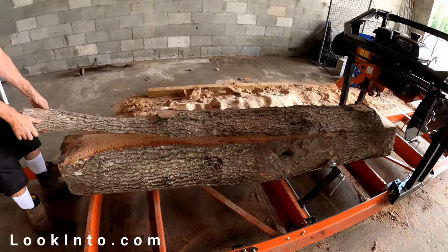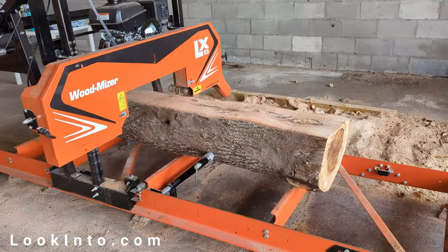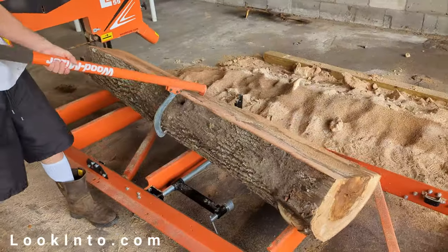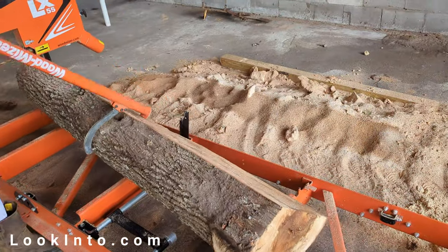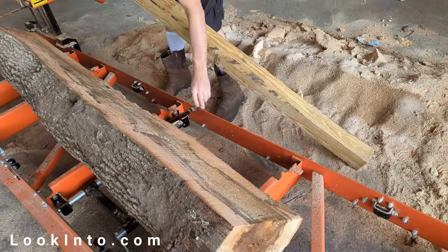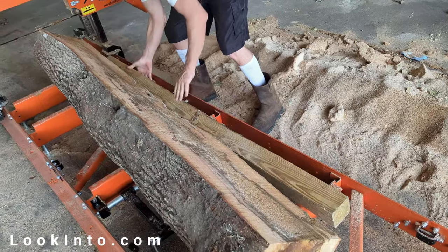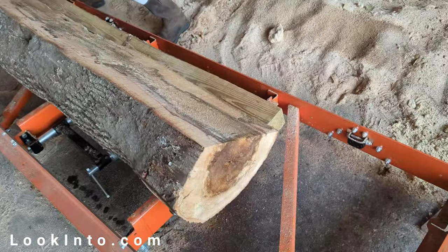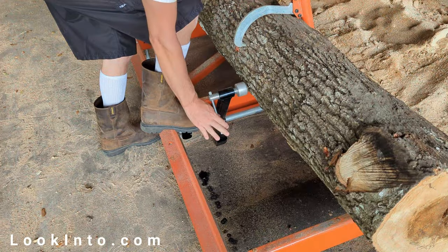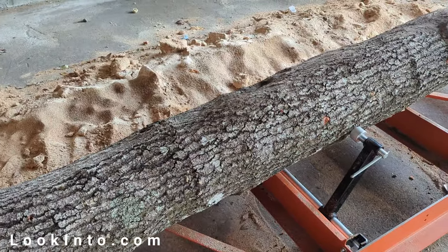Unless you plan to get all artsy-fartsy with the top layer, it's likely junk or firewood. Lower the head to the thickness you want for your first slab and cut — we're doing around two inches thick here. Now we have a nice large flat top as well as a slab of wood, and we're going to rotate the log 90 degrees. The mill has built-in stops, but this is a small log so a 4x4 works better and lessens the likelihood of plowing the blade into the metal stops. We finish the 90-degree rotation and lock it into place, ready for the next cut which will be perpendicular to the last.